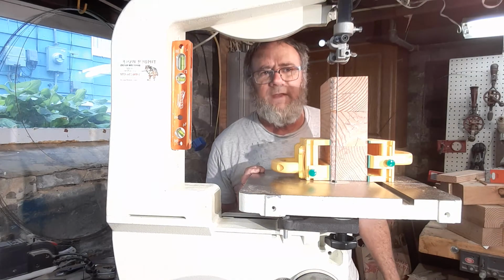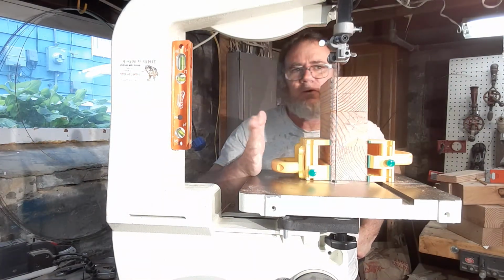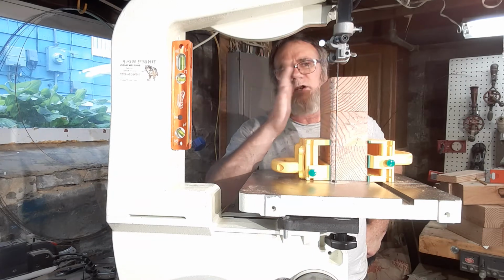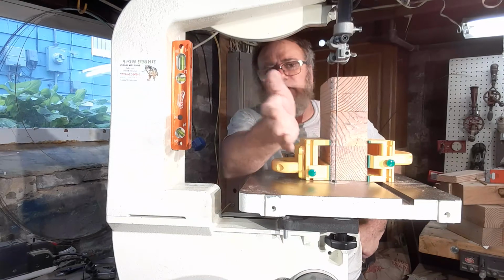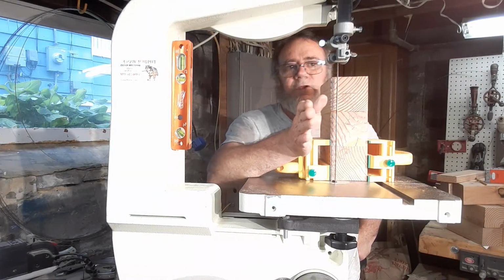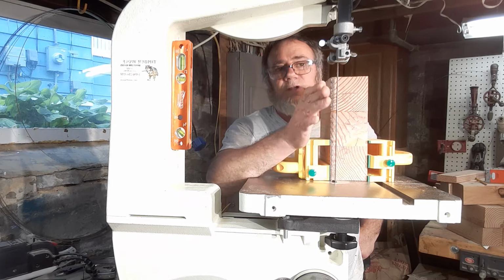I wanted to say one more thing before I started, and that is when you're cutting into your stock, you're better off going too wide, rather than thinner. If you don't try to make it perfect, unless you do this every day, then this conversation, we don't have to have it. I don't do this every day. So you want to go on the other side of the line, because should that blade start turning your block or going the wrong way away from the line, you've got time to recoup. That's why I say, when you start off, just go nice and slow.